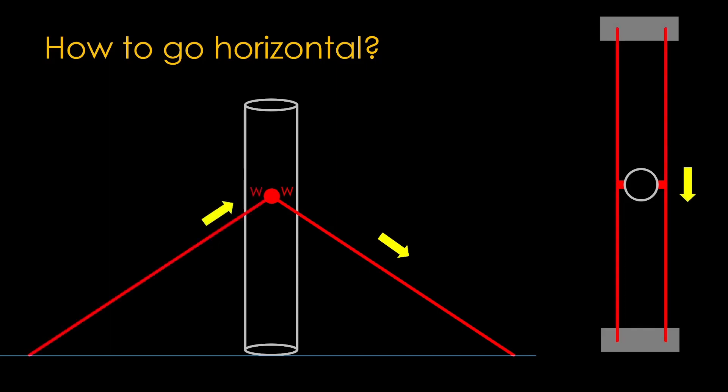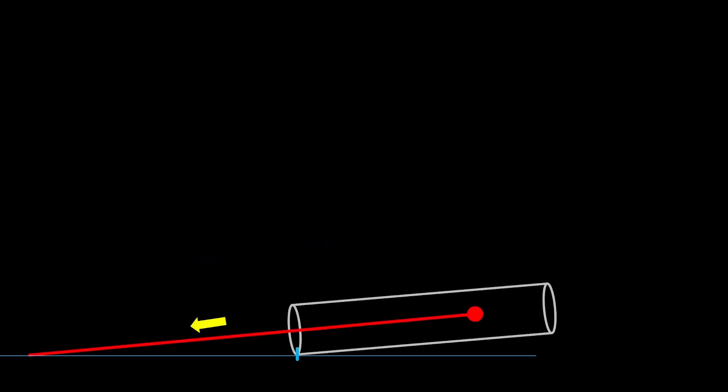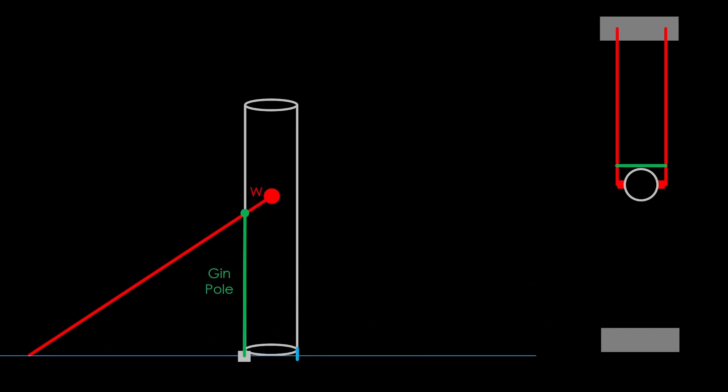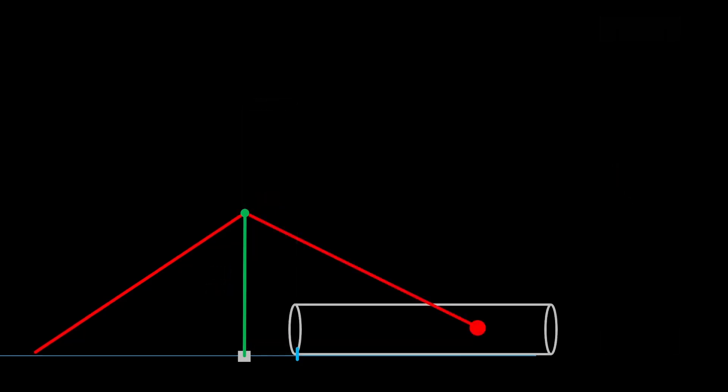Here's a top view. Then we need a second set of winches to slowly lower Starship down to the ground. And finally, we need a way to anchor the bottom right point of Starship so it doesn't slide away. Once we've gotten it tilted over, we can ignore the cable that pulls it over and concentrate on the lowering cable. A bit lower, and we're almost done — but we have a big problem. At this point, the cable stops helping keep Starship up and starts pulling it down to the ground faster. We need a way to keep the angle from getting too low. The solution is to add two support poles, known as GIN poles. The poles are attached to the ground and to the cables and serve to hold the cable up in the air. With the pole holding the cables up, the angle stays up and we can easily lower the Starship slowly to the ground — at least theoretically.